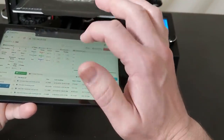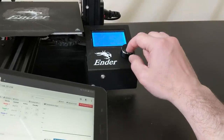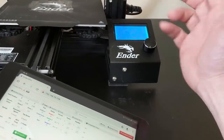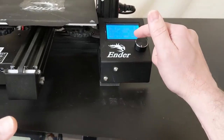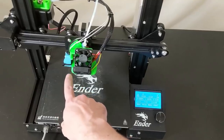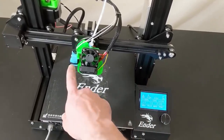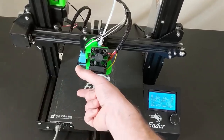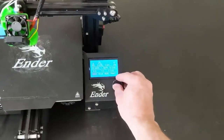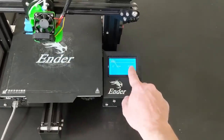Almost all of those controls are duplicated on the screen. I prefer the tablet over the screen, but it's nice that the screen is always attached — and it's really useful for one particular task: adjusting the baby steps. Baby steps are similar to Live Z in Marlin, and you need to adjust them based on how hot or cold your sensor is, because these sensors read varying heights based on temperature. The way I've set it up on the screen shows the probe temperature and the baby steps right there.